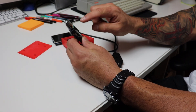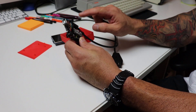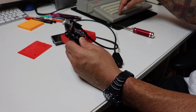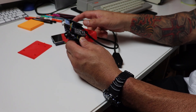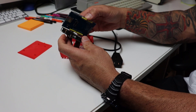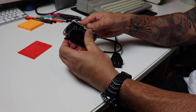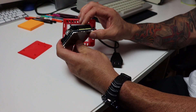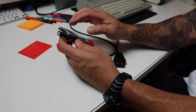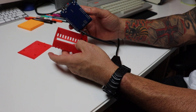One thing I didn't mention: this five-volt connection here can supply external power to the S-Drive Max where it doesn't require power from the Atari computer. That's probably something you'd want to do if you have the ability — so you're not draining current from the Atari. Basically, it's an Arduino board with a touchscreen, a 3D printed case, an SIO cable, and you're good to go.